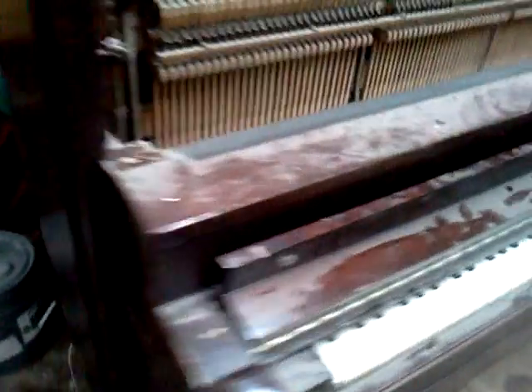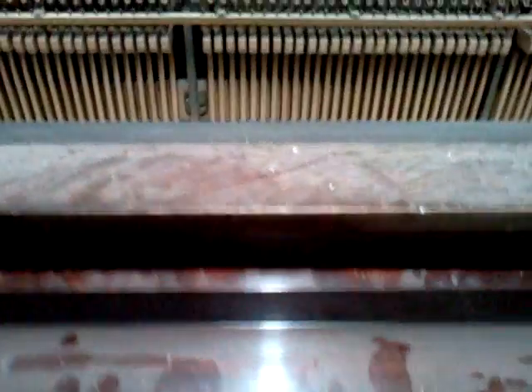Right now it's in a really dark finish. Typically what happens with finishes, as you see here, they darken over time. This panel was originally a lighter color, and from the different angles of light on it I'm going to guesstimate that it was a reddish mahogany color where you could see the details of the grain a little bit more.